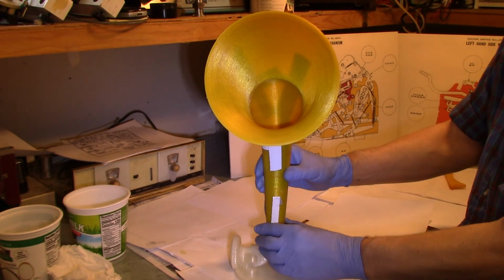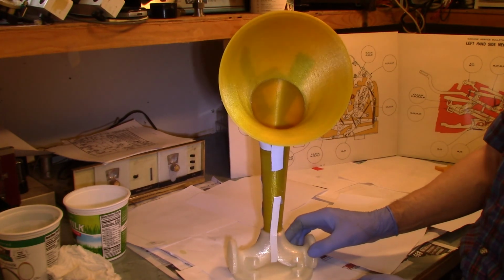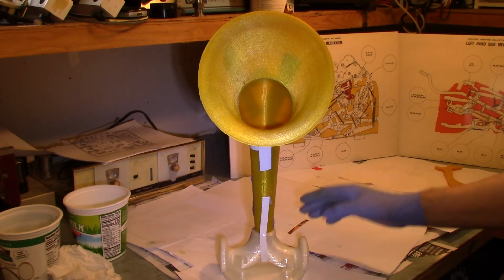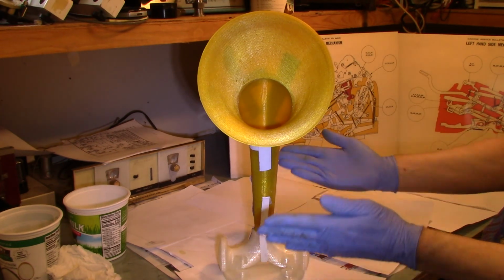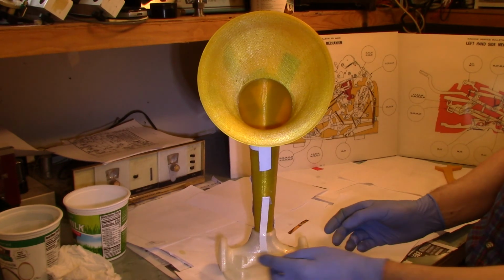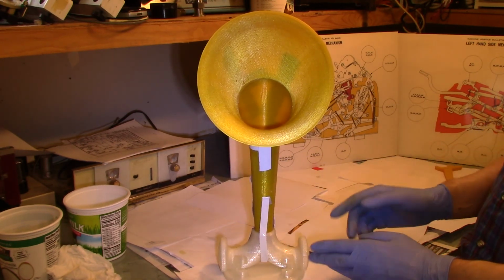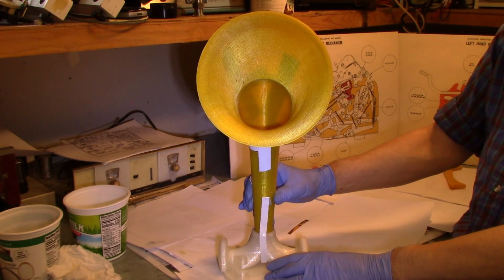And the reality is the original horn adapter thing I'm modeling this after, in roughly 1922, was an aluminum casting. And its horn actually was 90 degrees so that you could have the parting line work for the two molds, and then they had either a sand or perhaps a plaster of Paris core that you had to break up once it was molded. The aluminum had cooled, and so obviously the interior of that would have been pretty rough and textured, so it's kind of questionable how effective the original even was.